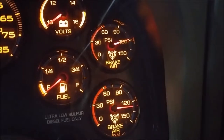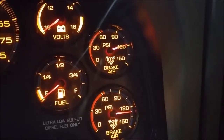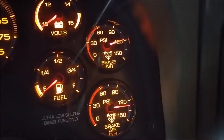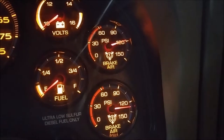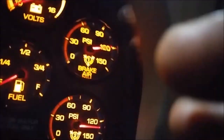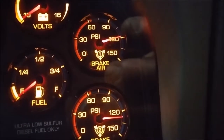Here are the gauges and we're watching tank one and tank two for two minutes to see if their pressure drops 4 PSI. The increments on the gauges are very large, so it is somewhat of a guess. If you see anything that looks like an excess of 4 PSI or greater, then it's definitely something you should further investigate with a better pressure gauge. We'll watch and see what the movement is here for another minute, thirty seconds.